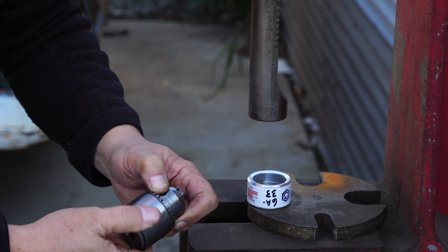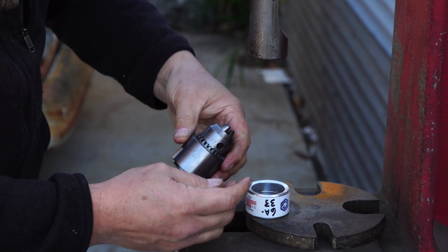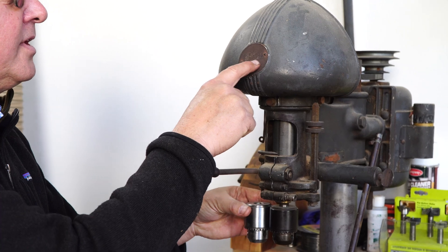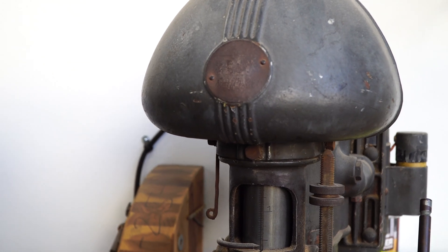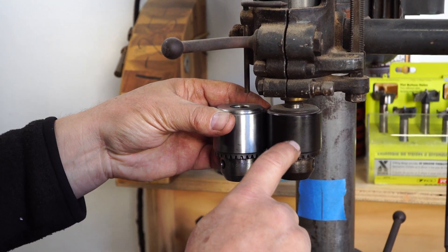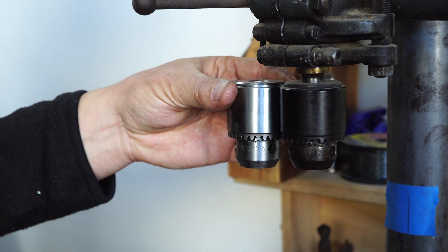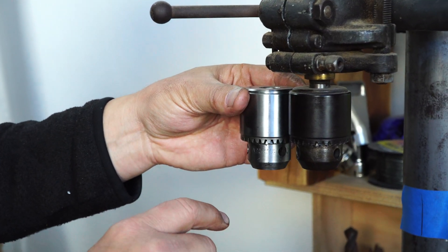That just glides on there perfectly. 6A. This might be what you see in your garage — Delta, Milwaukee, Rockwell, Craftsman, Sears — but it's got a 6A. This one has some sort of dark surface finish while this other one came in with a shiny patina. But 6A, 6A33 taper — you can see it in there, that taper where this goes.